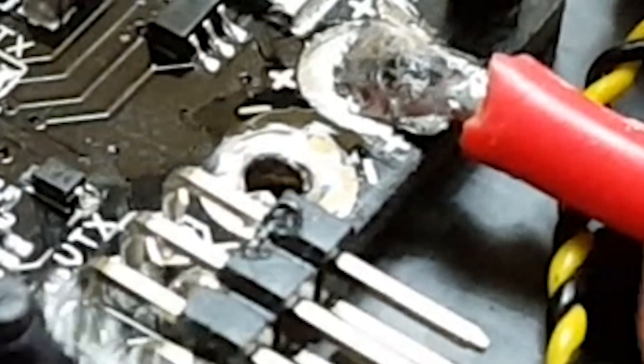The first thing I do is, of course, tin the pads and tin the wires — soldering 101. And then I give the joint just enough heat to stick the wire to the pad, just barely stick it. What you saw me do there is not a good solder joint. There was not nearly enough heat to fully flow all of the solder. We don't have a good fillet between the wire and the pad — it is just barely stuck on there.